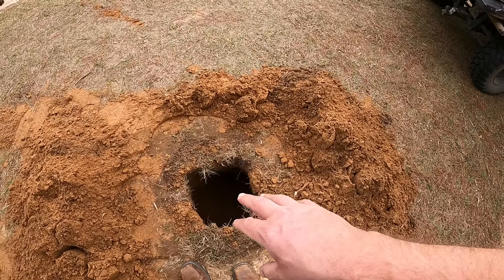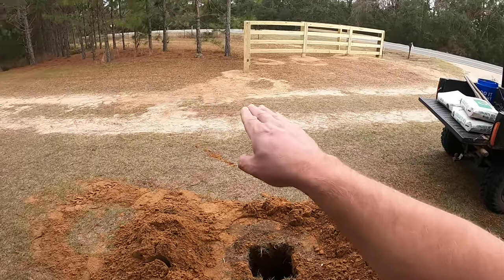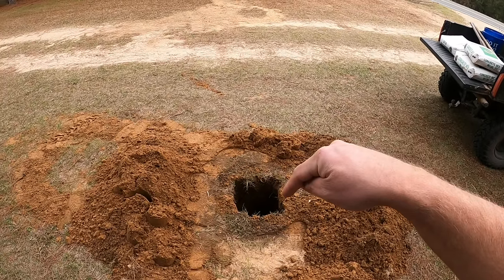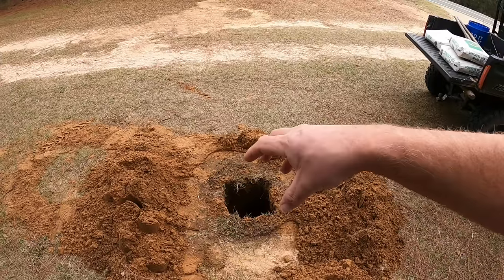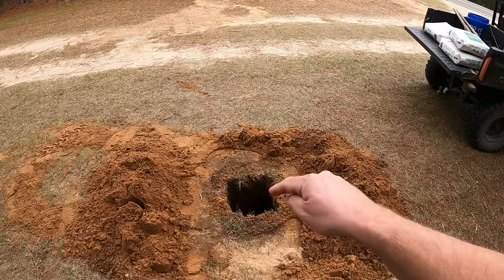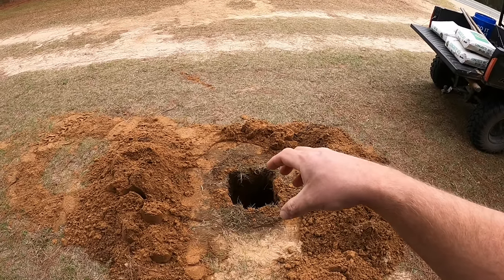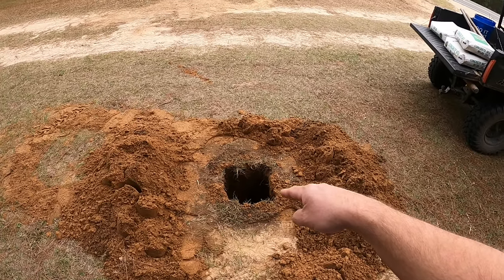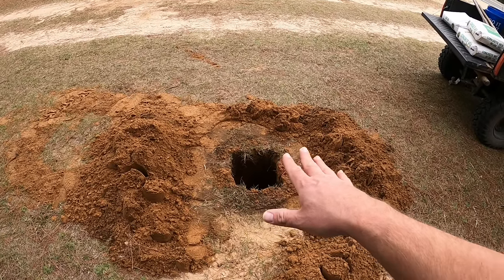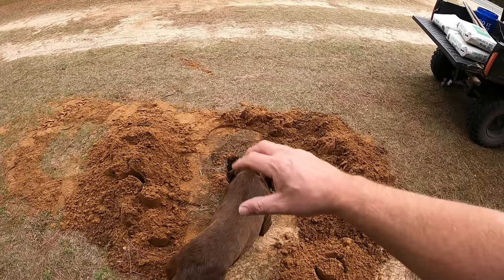Essentially, what's going to happen here, I had someone tell me that does a lot of gate posts for a living, that as a gate moves with time, if you just drill a round hole, pour concrete in it, or set a round post, for example, it can actually shift with time. Things can heave, move, stuff does happen. So if you have a square hole where the packed ground is locking in the concrete, or even do what I did, a pyramid shape, which gives you more stability, more weight down there, and really locks into the undisturbed ground, well, that can never twist on me. My gate post can never twist.